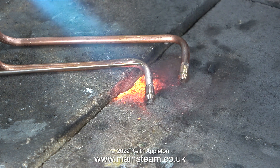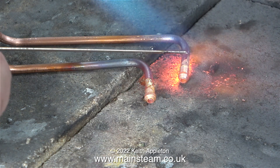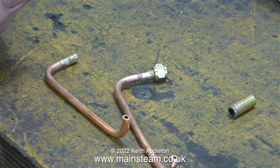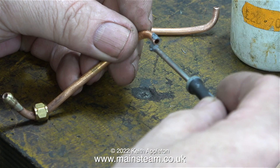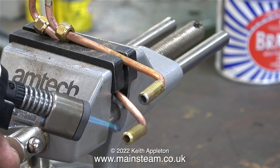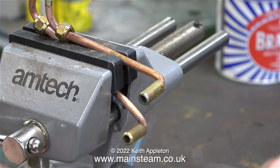I took the pipe into the outer part of the workshop and silver soldered a couple of coned unions on the ends. In the video it looks like I have the silver solder wire in the flame all the time, but I don't — it's close by. All I'm doing is touching the silver solder wire on the work when it's at the right temperature. I cleaned the pipe work using a piece of Scotch-Brite, then applied a small amount of soft solder paint, and using my small Proxxon blowtorch I heated the parts to melt the solder. As a belt-and-braces approach, I also applied a little bit more at the end of each union.